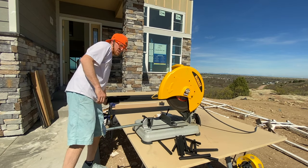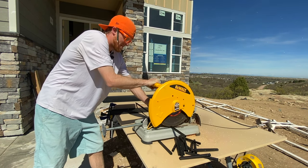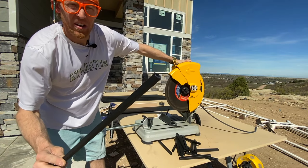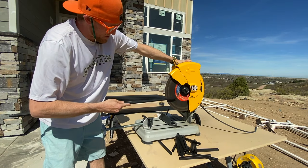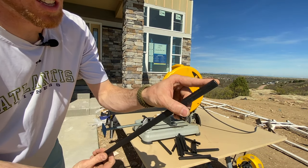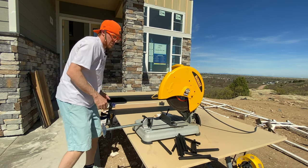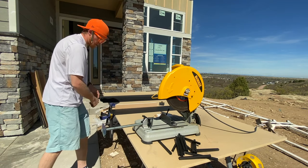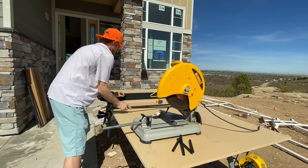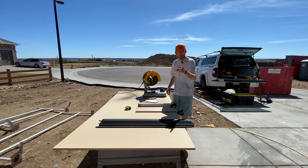You can see me laying them out and cutting. After cutting, I'm scratching those little burrs off the edge — whether you can see them or not. It makes it easier so you don't cut your finger, and more importantly it lets the baluster slide down into the hole nicer. You'll see later why that matters. 52 of those — done.